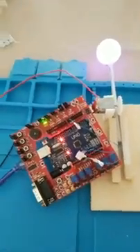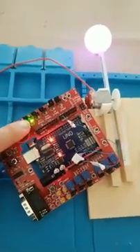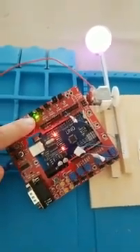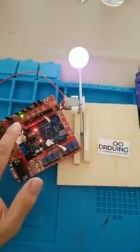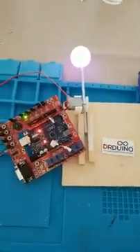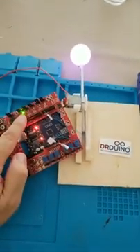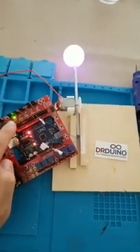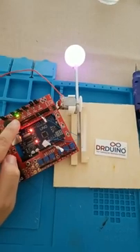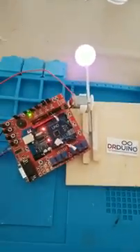And that's how I use the Dr. Duino shield. I also like to have a continuous blinking LED, just so that I know the program is actually alive and doing something. Because sometimes you'll think the code is running but in fact nothing is happening at all. Whenever I write any of my code, I always put what I call a heartbeat LED. If you downloaded my Arduino master PDF, that is actually something I speak about in the PDF — just always having a heartbeat running.